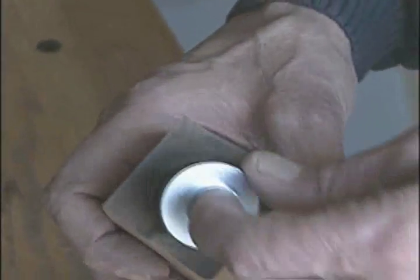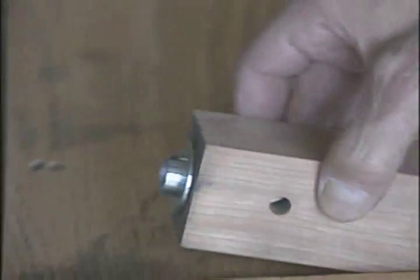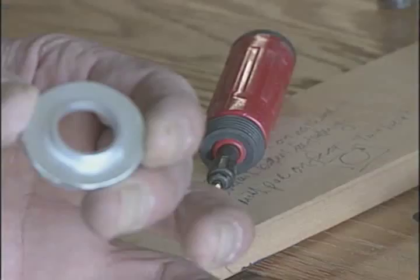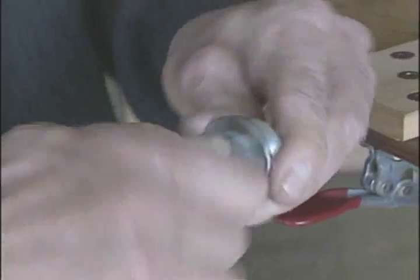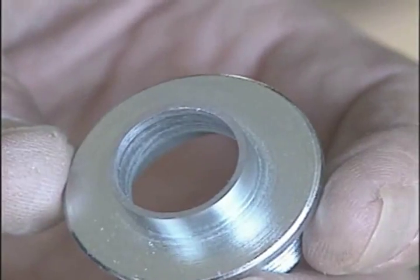I made this little holder for grinding. Just lightly brush the collar up against the center and smooth it out. After that, I'll deburr it. This is a neat and inexpensive little machinist tool that just scrapes away the burr. But you can use wet or dry 220 silicon carbide paper just as well.